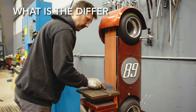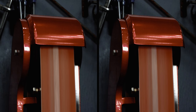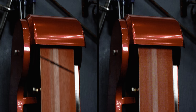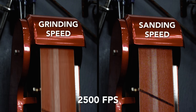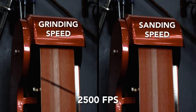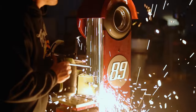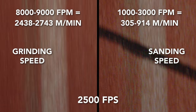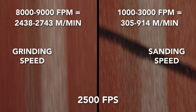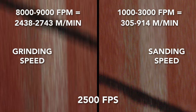I'm looking for a grinder and I want to know the difference between a grinder and a sander. Here I have my go-kart grinder. From what I gather, the difference between the grinder and the sander is the surface speed of the belt. A sander I typically would use for wood because of the low belt speed — somewhere in the 1,000 to 3,000 surface feet per minute.